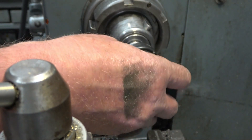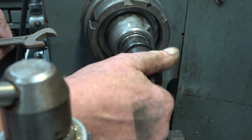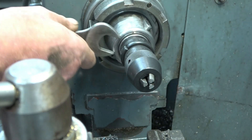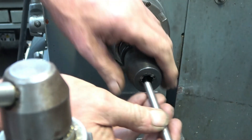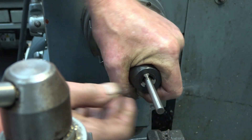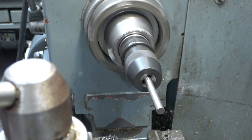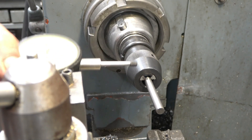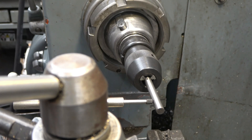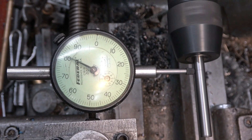You could Loctite this chuck on here, but it's not going to be turned backwards — it's forwards — so it doesn't need to be. Quite slack on the thread doesn't matter because it's that face there that lines it up. We put this in, which is going to be a round dowel pin. Looks good — we'll put a clock on and show how good it actually is. It's got probably three or four thou run-out, which is certainly near enough for a drill chuck.